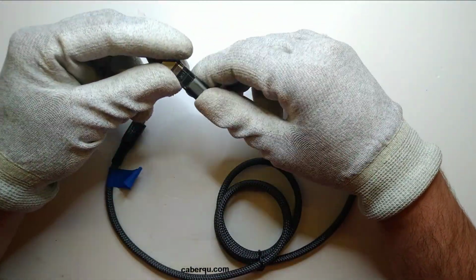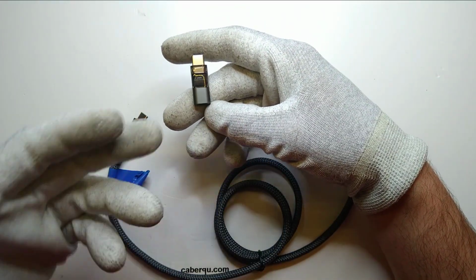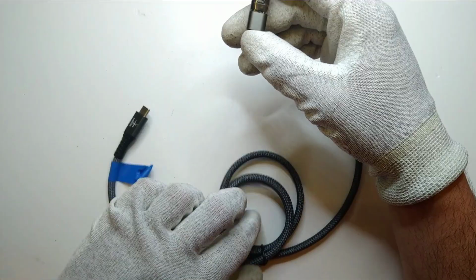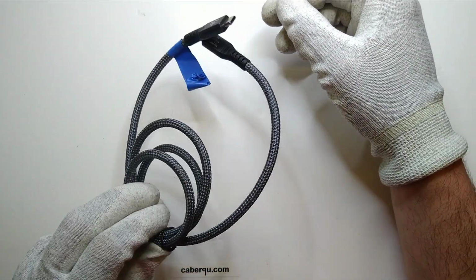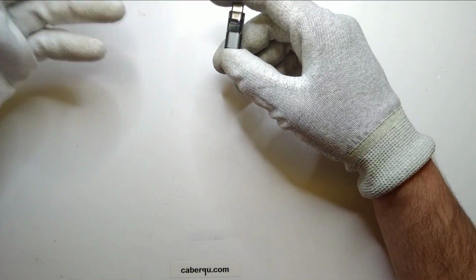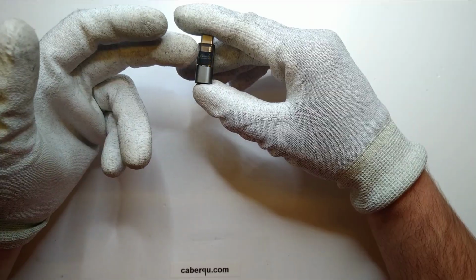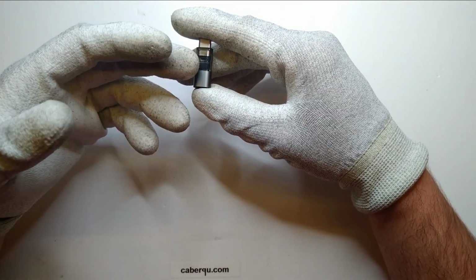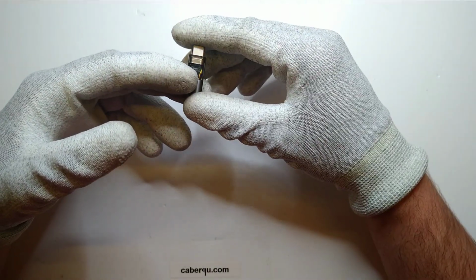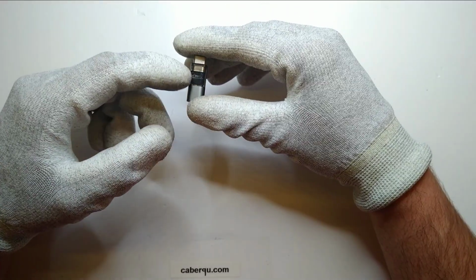With this, I can now tell you I still support using USB data blockers, but as is generally the case with the USB-C standard, it is a bit of a mess, because it's really complicated, and it's unintuitive for people to know that not only is your phone talking to your charger, but your cable is also talking to your phone while charging. So there's one piece of active electronics inside that people do not know about. I would still use it in public spaces where I'm wary of actual hacking going on, but I would definitely not use it for power delivery negotiations of anything that can fast charge above the regular, let's say up to 3 amps, but even there, I'm not sure.